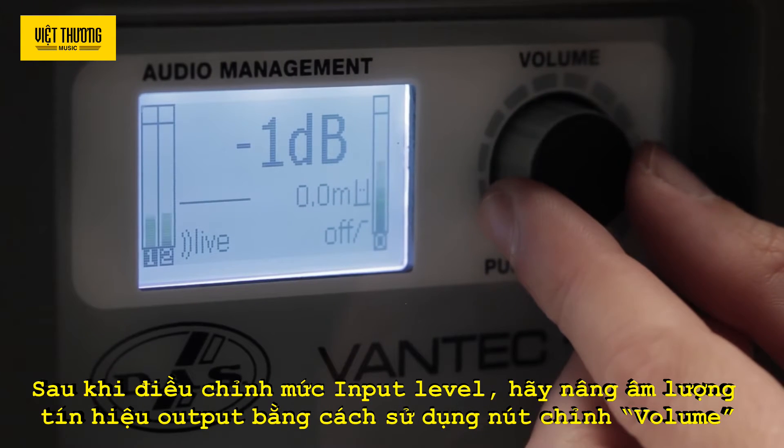Main Menu. Now that the levels are adjusted, it is time to access the DSP settings. This is done by pressing the volume control, which brings us to the main menu. Turn the knob to run through various menu options. Press the volume control to access any of the configuration parameters. If you want to go back, select 'back' on the screen and press the volume control again.